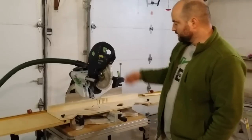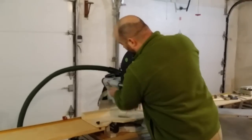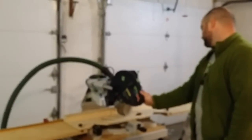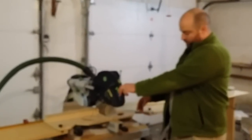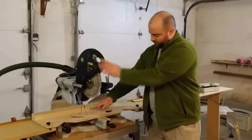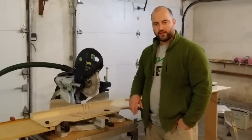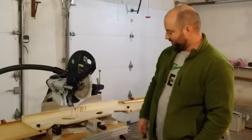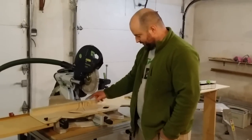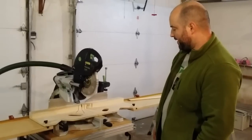And you're good. When I use this jig, I tend to sometimes forget to lock the saw in this top mode. And what that prevents me from doing is cutting through the whole jig. At this point, when the saw is down, the back edge of the blade doesn't go much past this edge. So I don't cut my jig in half. There's a few times I forgot, and that's why it's in as bad a shape as it is. And it probably needs a little rebuild. It's seen better days, especially over here. We got a little damage, but we'll fix that up eventually.